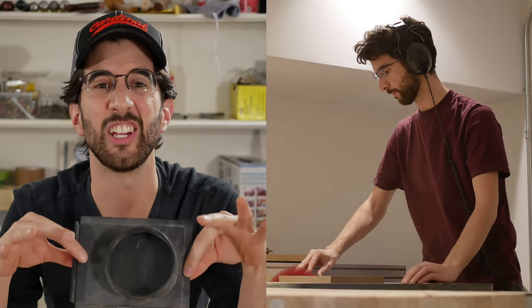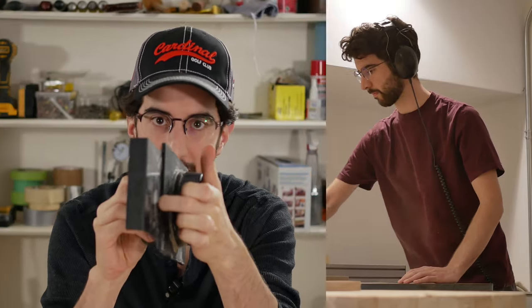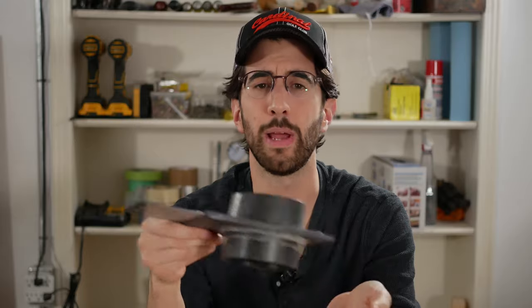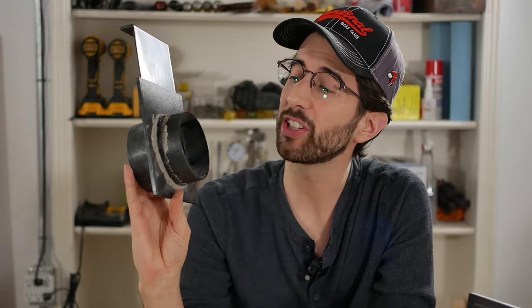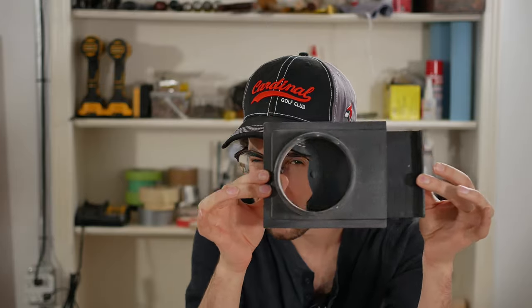Why would you build your own blast gates in the first place? These are like ten dollars but they're kind of crappy in many ways. The inside diameter is smaller than the inside diameter of the pipe, so it reduces the airflow a little bit. They're extremely leaky — you can kind of see directly in there if you look close enough. There's no way to mount this to a wall or anything solid because there's nothing to screw into, so it's just hanging in free space. In my experience they get majorly jammed up with sawdust in the little crack there, and you have to pick it out with a needle or it won't close all the way.